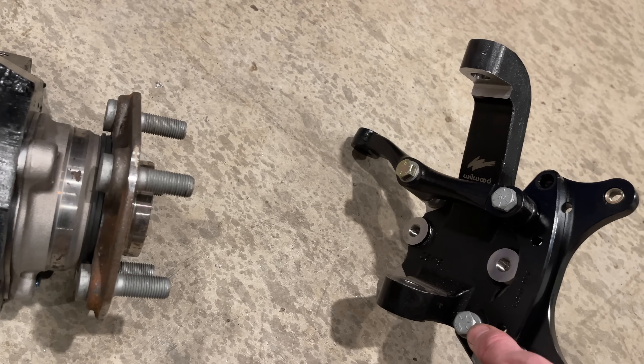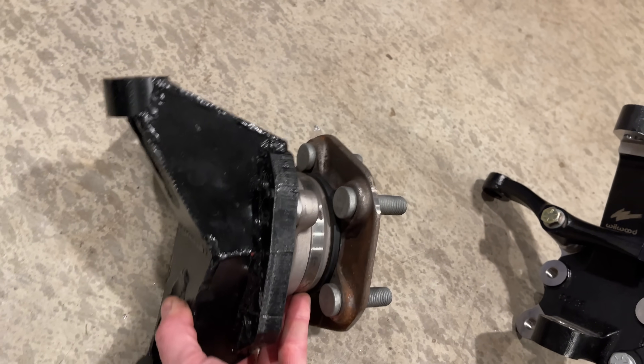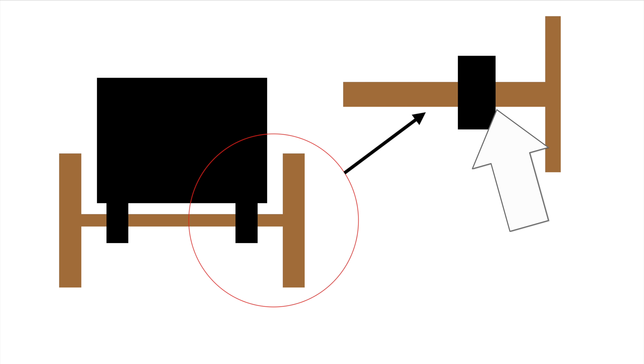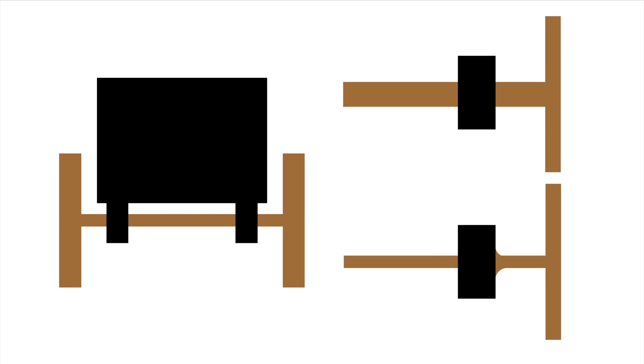Here's a quick story about early mechanical engineering. In the long, long ago, spindles were just straight rods sticking out of a buggy or a train. Sometimes they would break, and they would always break in the same spot — right at the attachment — because a sharp edge makes stress go way up. If you just make that sharp edge less sharp, say with a radius, the stress goes way down — so much so that you can make the entire spindle smaller and it's still stronger.